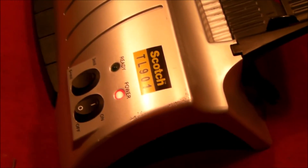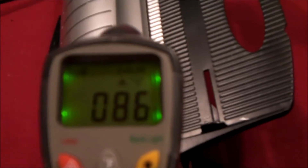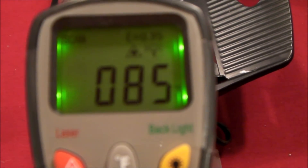I've got the laminator on — it's been on for about 2 minutes now. I've got my thermal gun here; let me take a quick reading. You can see the ambient temperature around the machine is around 68 degrees. Reading down through the slot, it's already up to 80-some degrees. If I had the cover off I'm sure it would be hotter — the thing is definitely heating up. Right here on this surface it's 87 degrees already, whereas the surface on the cool side is 69 degrees. Right there it's already 90 degrees — the thermal laminator is definitely heating up.